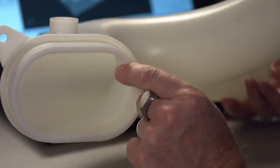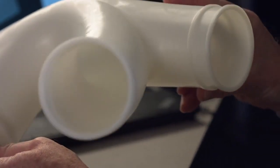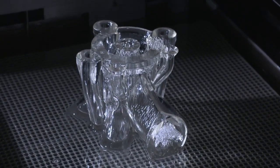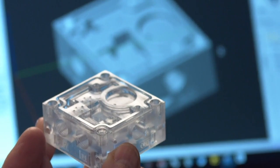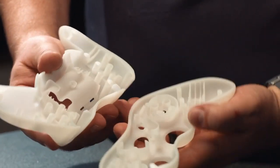There are a number of features of materials that are critical for use in Stereolithography. Low shrink is one, having materials that are robust, having materials that work in liquid format with the machine, and working with R&D departments to match the particular applications that they're going after. Now that R&D world is different from people who just want to crank out prototypes for form and fit and verifying and helping their product development.